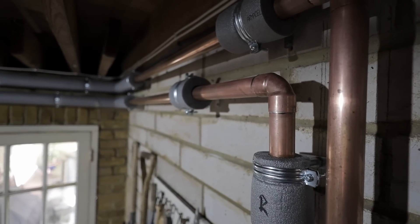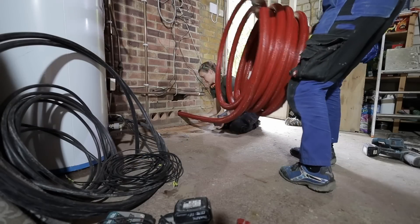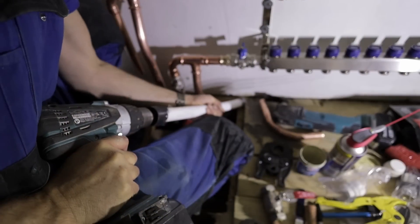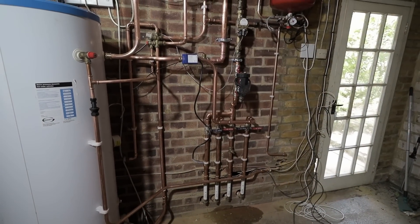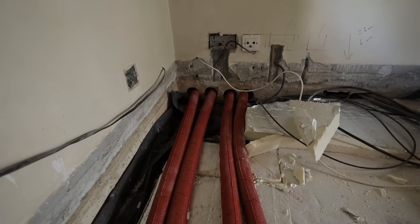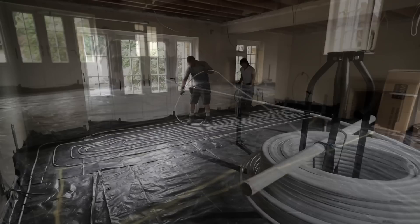This resulted in a cold house and really high electricity bills. So we're going to run 35mm copper from the unit to a new diverter valve, then from the diverter for heating we'll run MLCP 32mm pre-insulated pipework. For 12 kilowatts it should be 40mm, however I'm going to run two sets of flow and returns — one for the ground floor for about six kilowatts of heat loss and another six kilowatts on the first floor — both on 32mm MLCP pre-insulated pipework. We're using pre-insulated because we're running it within an insulated slab, and then we put another layer of insulation on top.